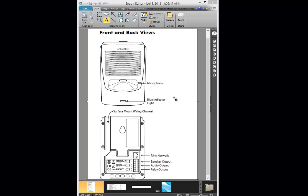So if you had a shipping warehouse where you wanted the night bell to ring at the same time that a person's phone rang, you could set this up and twin that person's extension as their additional phone, so every time the call rang, it would also ring the night bell. Or if you just use traditional paging, you can use the relay output to do the contact closure, so it'll close the port. And on some paging equipment like Bogen, once you close the relay, it will do the inherent ringing on that amplifier.